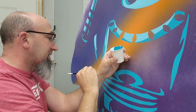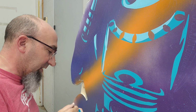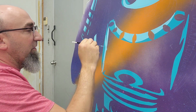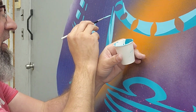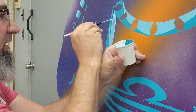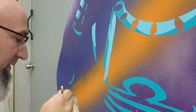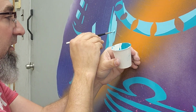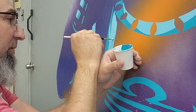But now when I come back, and I see people that'll do the whole outside and then they'll come back and fill in, I personally don't like doing that, because when you do that whole outside and you come back and fill in, this is dried. And where this part overlaps that part, there's a line in the sheen, and you can get that to go away and be smoother if you work across. So I'm just going to try and work across. If I want to get that top part along there, I'm going to get a little bit of this, and I'm going to come back and hit that with a short stroke. But right now I can work that. And I want to work quick, because the quicker that I work on this, the more those are wet while I'm coming across. It allows that paint to level out while it's drying.